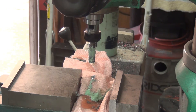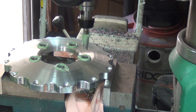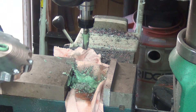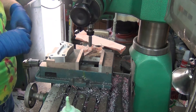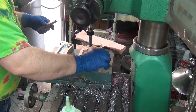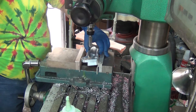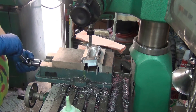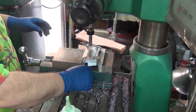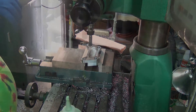If I can tap the brackets like this, I'm going to be in seventh heaven. This one goes to the sink to get washed off. I reversed the jaws around again and put them back to where they should be. I went ahead and cut a couple pieces of scrap aluminum angle I had laying around — I just need them to get it in there and get it started, then I'll pull the parallels out. It doesn't have to be incredibly accurate, and I don't have to grab it extremely tight either. I just need it to hold well enough so I can drop down into those two holes with the tap, because I won't be able to hold it by hand torquing it. We'll see if it slips or goes.